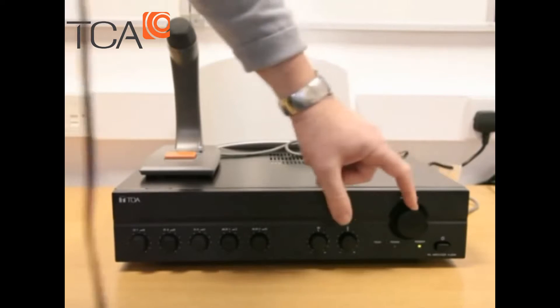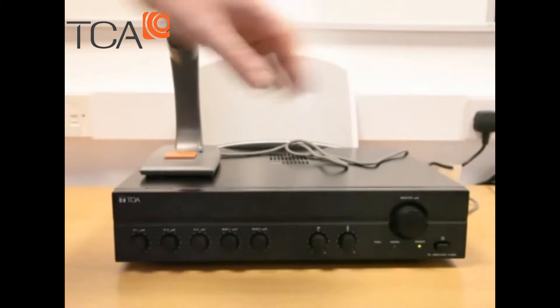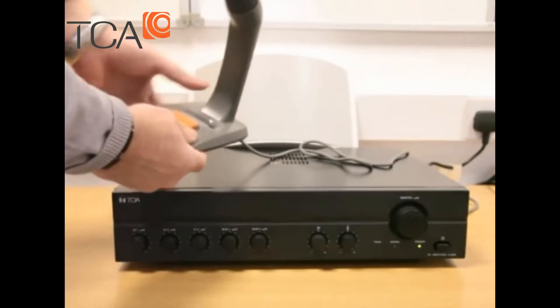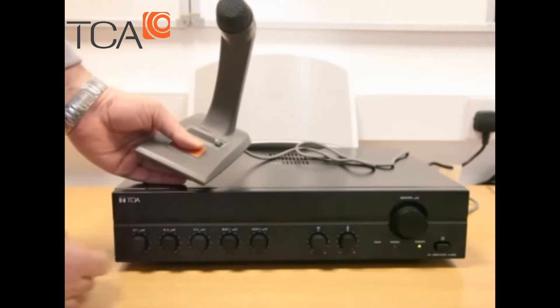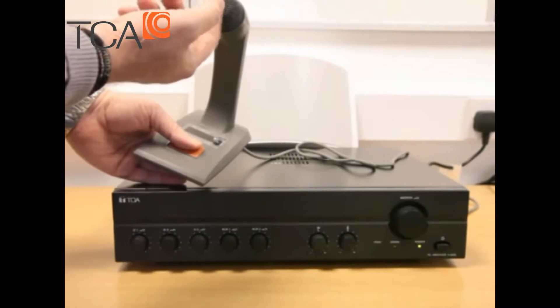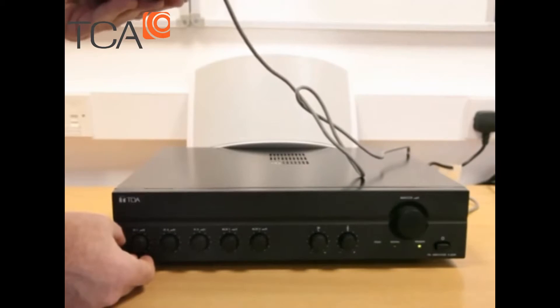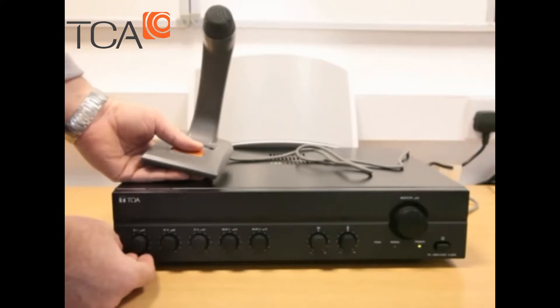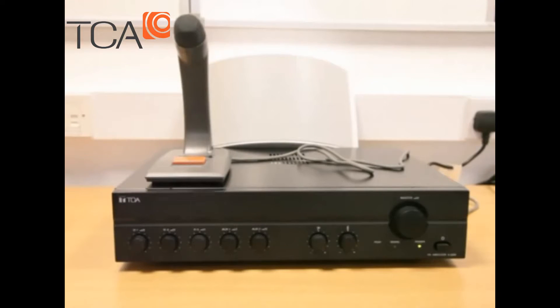The master control now wants spinning around to around about the 1 or 2 o'clock position, so we're not operating at either top or bottom of its travel. Then by keying the microphone switch — the talk switch in the centre — we now have the microphone live. We advance the volume control on channel 1 until we get a level we can hear coming through the loudspeakers. There's no sound of feedback. If we talk through the microphone, we've got a satisfactory level. Once released, the mic is dead and nothing is being broadcast on the system.